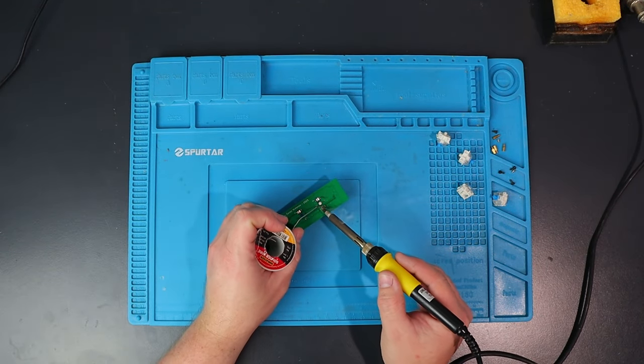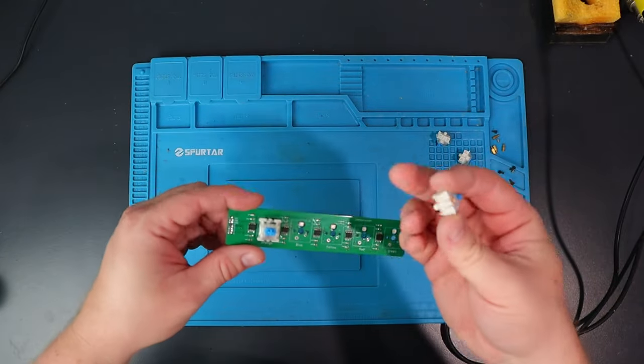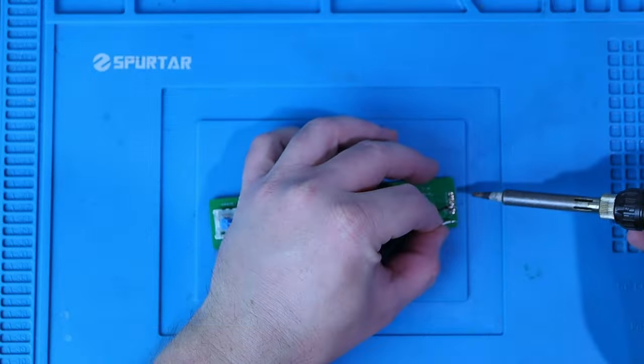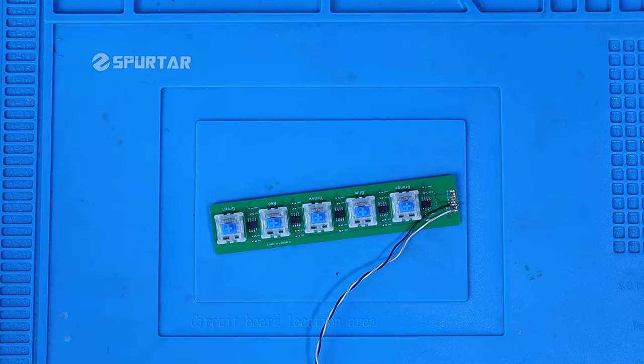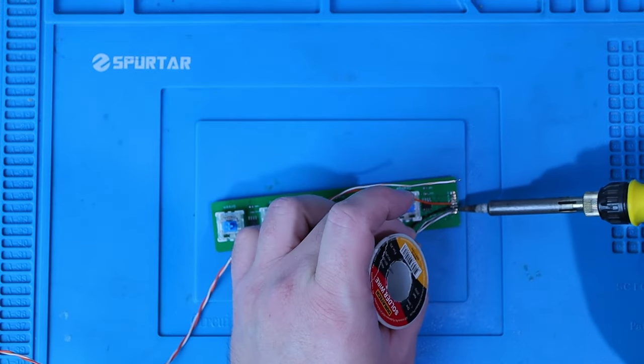There's a total of 8 wires that need to run down the neck, one for each of the switches, a ground, 5V power and a signal wire for the RGB LEDs. I'm going to leave about 150mm hanging out the end of the neck, so they can be easily connected to the strum bar PCB once the neck is attached to the body.